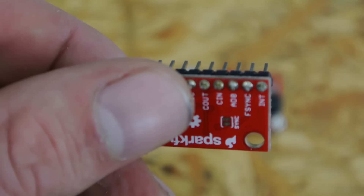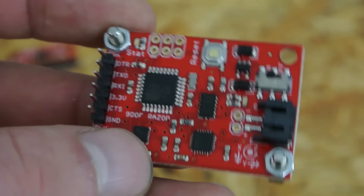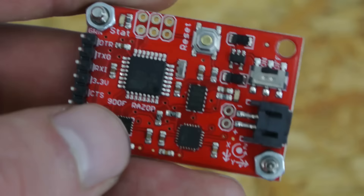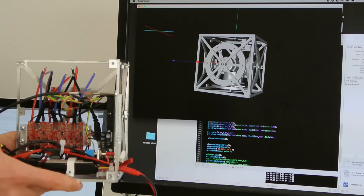I always need to know the current orientation of the cube. For things like that I used this MPU 9150 in the past, but it's quite noisy and was always a pain to work with. So I decided to try out this IMU board, which has the added advantage that it has its own programmable microcontroller. So you can do the needed orientation calculations on board and just send the result to the main microcontroller. I made a Cinder app to test it. Although I still need to do some tweaking and calibration, it seems to work really well.